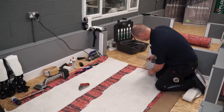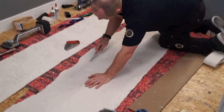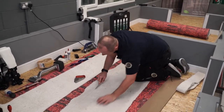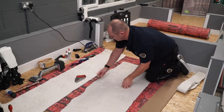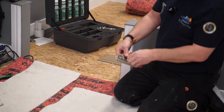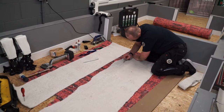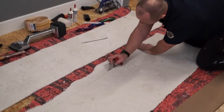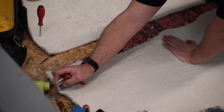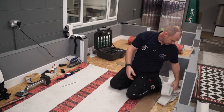For the second piece of carpet, again with the pile direction, just take that down very quickly. Second time, lowering it and opening that channel up again. On the loop pile cutter we're going to swap the blade to make sure we're cutting it as close to the pile as possible, then simply taking it down and removing the excess.